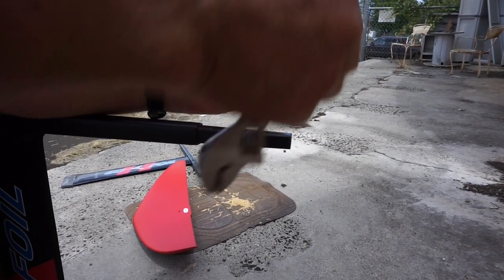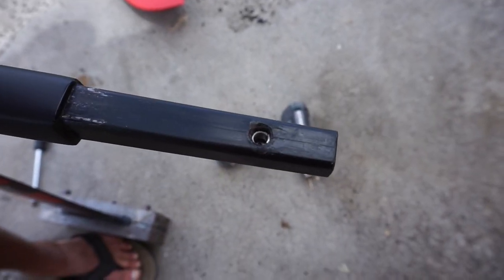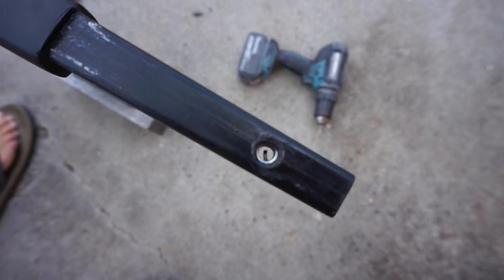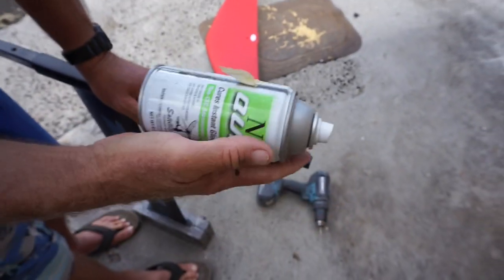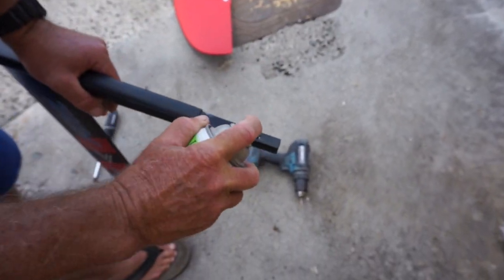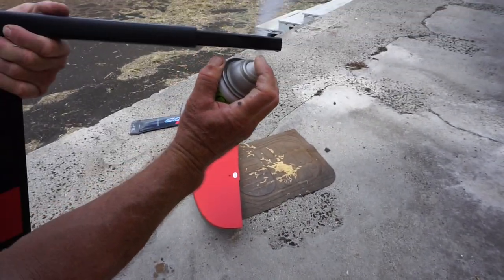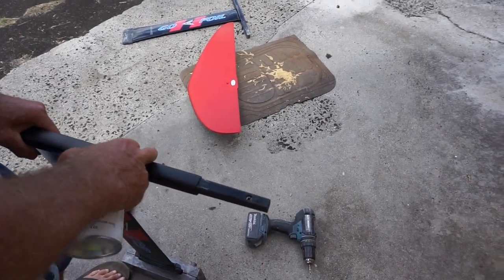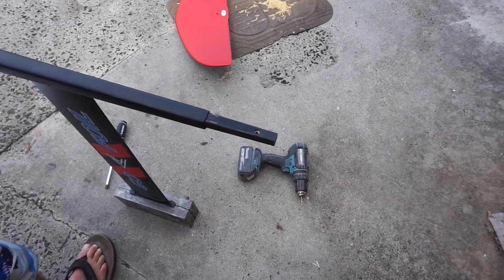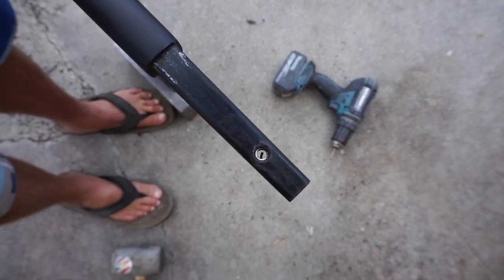Now I back out my insert tool. Look inside there — you've got a brand new helicoil and you see the tang is still in it. We have to remove that tang. So the next thing I do is take my super glue accelerator spray — this stuff makes super glue go off in about five seconds. So I spray it in there, on top and on the bottom. This will make my super glue go off immediately. I can touch it now — it's gone off. And look, now you've got your helicoil. It's got a tang in the bottom that we're going to have to remove.